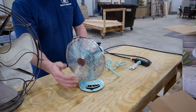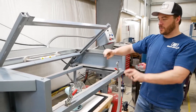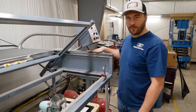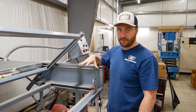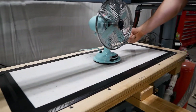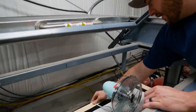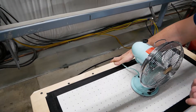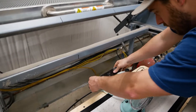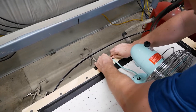It's much quieter and much smaller too. Let's form it. For this episode we're back on our two-by-four machine — about two feet by four feet of forming area. This pulls about 27 inches of mercury, so that's about 13 pounds per square inch of force. The way these work is we've got to seal the plastic around the entire perimeter of the platform to get the vacuum to pull. The problem we're going to have by adding this cord is we potentially have an area to lose our vacuum right here. We're going to be lazy and just duct tape this and hope the plastic can still seal there. If not, we can notch out this corner a little bit and put some tape over it, but let's do it the easy way first and see if it works.